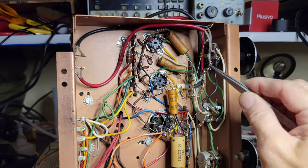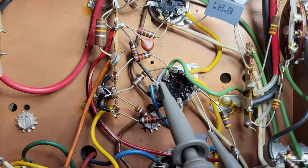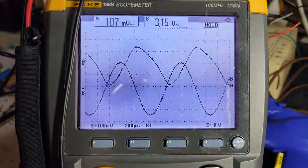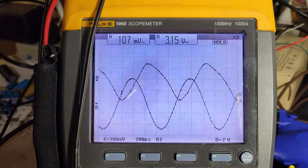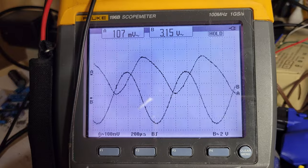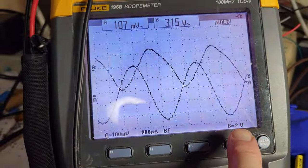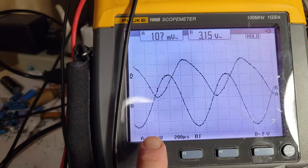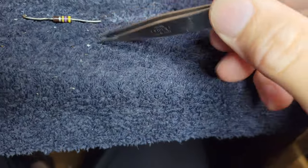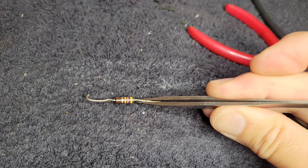22 nanofarads and 47 nanofarads — easy. Trying to track down the problem in this amplifier, I disconnected feedback or put the feedback resistors to ground, and now we're looking at the plates out of the second tube in the amp. The signal at the grid on the bad channel isn't great either. Channel B is looking peachy; channel A — not only is it messed up but it's really low amplitude. Channel B is on a 2 volts per division scale; the other is at 100 millivolts per division. They replaced the plate resistor here — the old one had pretty much failed completely open. So that was an open circuit, giving us no voltage there.